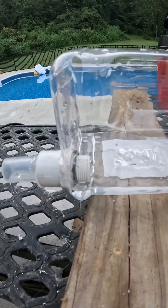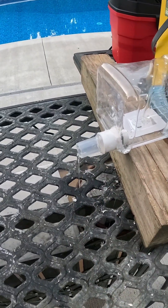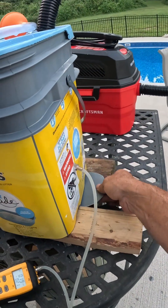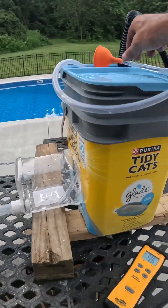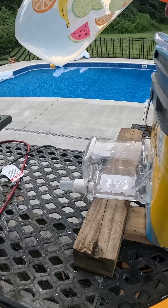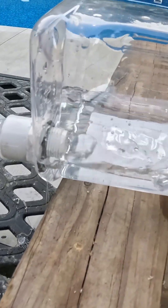In a drain pan you've typically only got about this much space, so that water is coming back, splashing, and it'll splash over the drain pan and start to get everywhere. When the furnace shuts off and that negative pressure stops it's able to start draining. The dirtier that filter gets the more negative pressure you're going to have. We've seen some really bad filters — a 0.39. The air conditioner running and making water, the water is trying to go out through gravity but the airflow coming in is great enough to pull that water back, and it starts to get more and more violent.